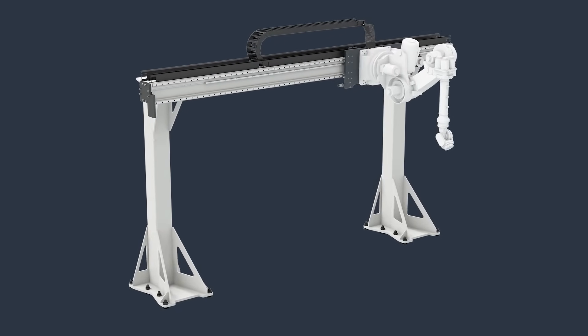An elevated system can also keep the robot up and out of the way of the workers on the plant floor. This can be a big deal because moving equipment or changing the layout of a plant floor to fit a floor-mounted RTU can be expensive and time-consuming. For applications where elevated robots are a requirement or a major advantage, for overhead press tending applications, elevated systems allow a robot to reach into the press from the top.